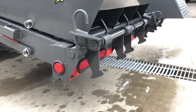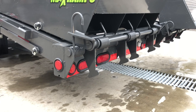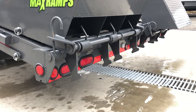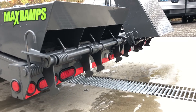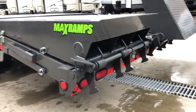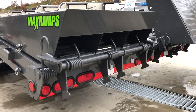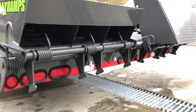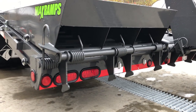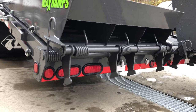Most of your better manufacturers in the industry are going to use a four by eight tubular bumper to rear — this does have that heavier bumper. You'll also notice there's a weep hole at the end for any water to get out. Spring assisted of course on your ramps — those are some pretty healthy ramps, we put them on at probably 300 to 350 pounds per side. A few extra marker lights: the three centers are required, a stop-turn-tail on the outside is also required, and there are two of the stop-turn-tails with an extra marker light to the side.